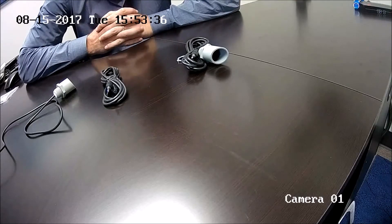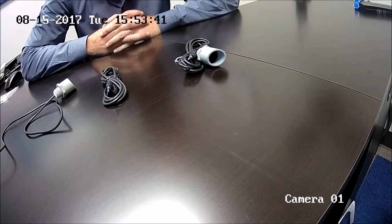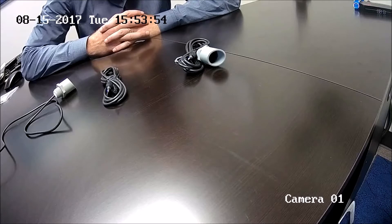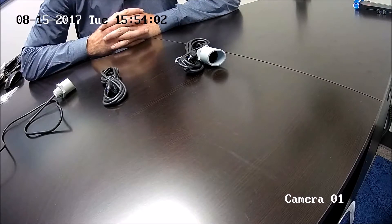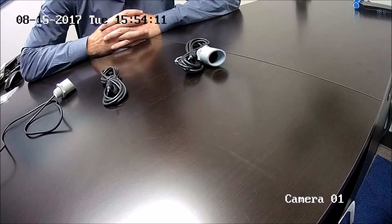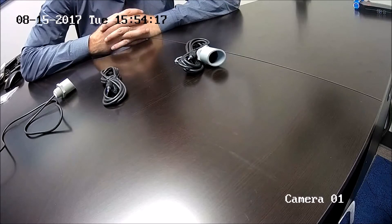Today I'd like to talk about our two new microphones. These are unpre-amplified microphones and they work with IP cameras that accept mic level inputs. Note that not all of our IP cameras with a microphone input can accept mic level — some can only accept regular line level. Most of our four megapixel IP cameras that we currently stock with a microphone input do have mic level abilities, and pretty much all of our PTZ cameras have it as well.